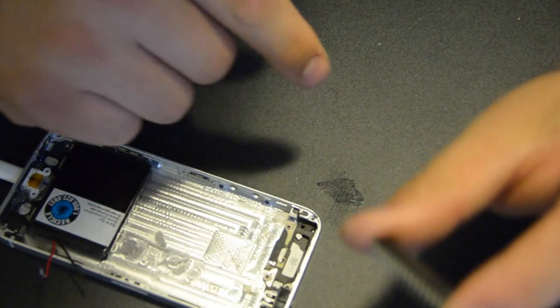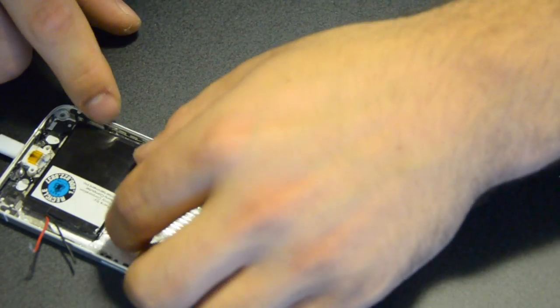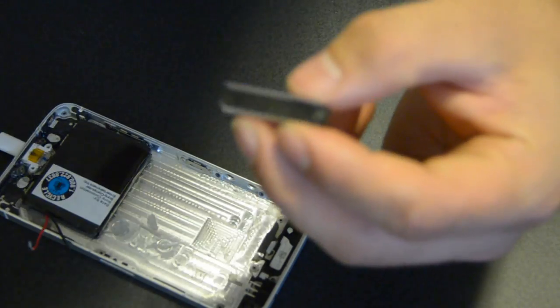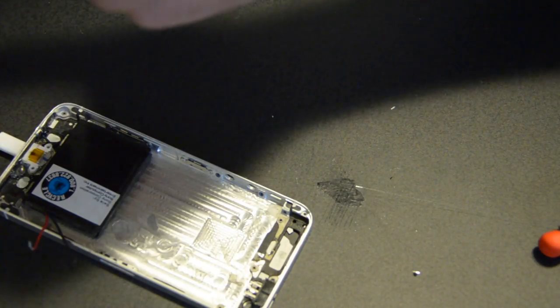So most of the pins for the TFT were on this side right here. So I'm probably gonna glue it this way, so I don't have to cross over as much onto the IC. But I guess before I glue it, I'm just gonna go ahead and trim some of these leads down. But now that I got the leads all trimmed, it's ready to go in here.